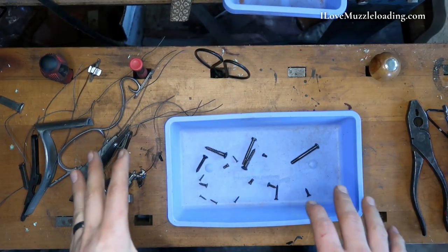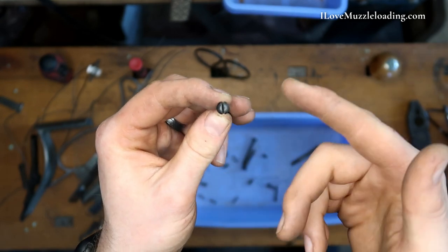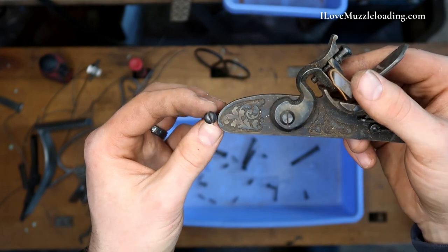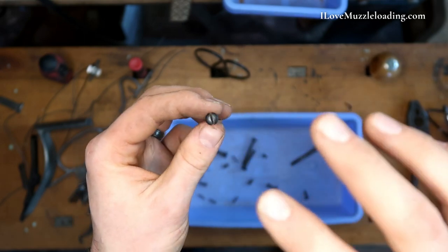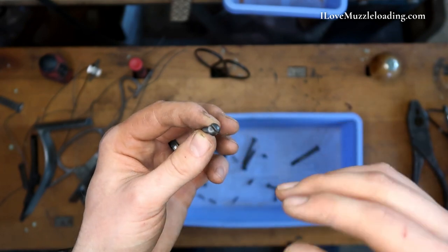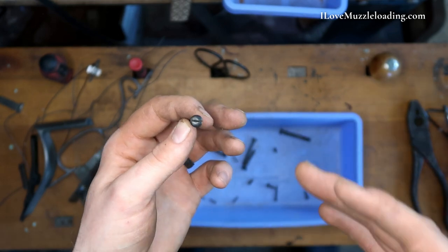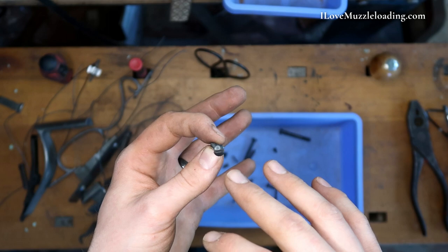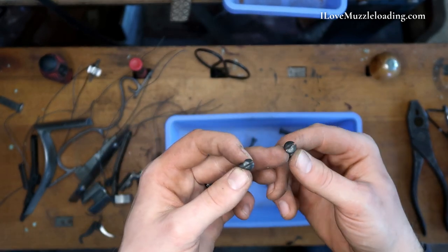Before we move on, I want to address something I see in a lot of kits, and that is our screw and bolt heads. When we look at this bolt head or screw head, it's a nice matte black finish — a blackened brass-esque look. If you wanted to go through and cold blue or rust blue this kit, you could do that. Because I've cleaned up and I'm going to be rusting the rest of my hardware, I want my screws and bolt heads to match. You'll see in a lot of kits where folks get to this stage and they've forgotten about all of their screws and bolts. So I'm going to take some files and sandpaper to each and every screw head so that we get it to match, and then we'll rust all of them at the same time.